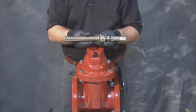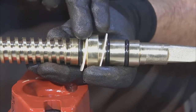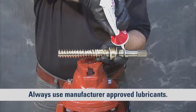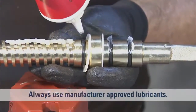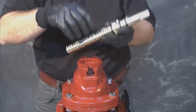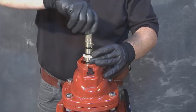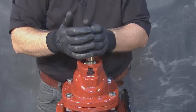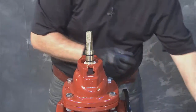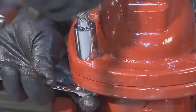Be aware that if the stem you removed was damaged or difficult to thread, it may need to be replaced. You should now verify the placement of O-rings and thrust bearings and, using manufacturer-approved grease, lubricate along their threads. With the stem ready, lower it through the opening of the cover until you feel the stem threads impact the previously aligned stem nut. Begin to turn the stem in the direction of close for this particular valve. It should thread with ease and lower until the stem begins to raise the wedge in the body. At this point, you can finish tightening the bolts and nuts previously left loose to their proper specifications.